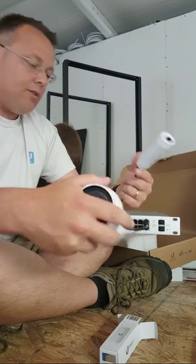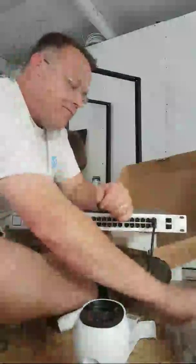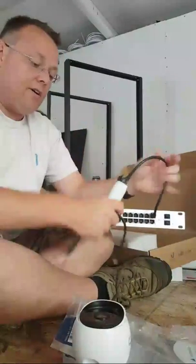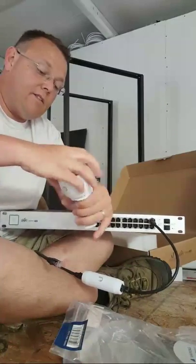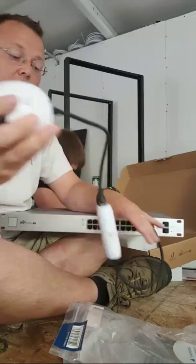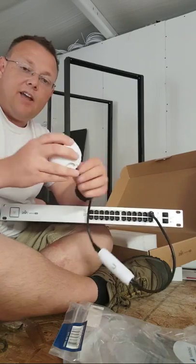Then we will go to the patch panel. This will plug into the patch panel, and eventually it will plug into the camera. So you take your adapter, plug it in, and go into the camera. Of course it's not going to look like this because this camera is going to be mounted with a structured cable run back to the patch panel. But physically in the end it will be similar to this. This guy will knock down that full PoE into passive so that this camera can operate correctly.